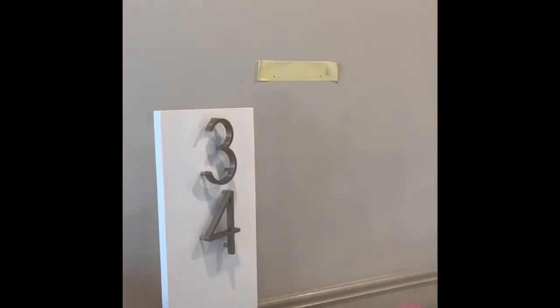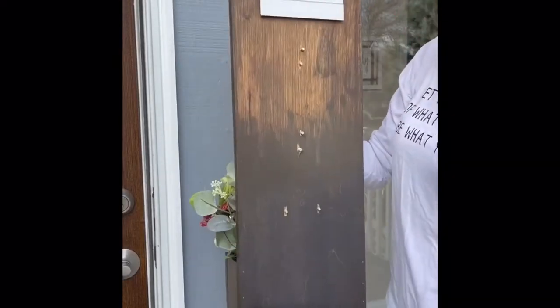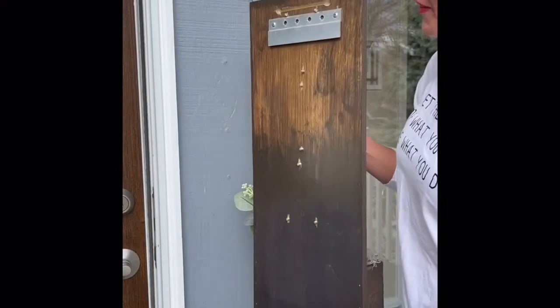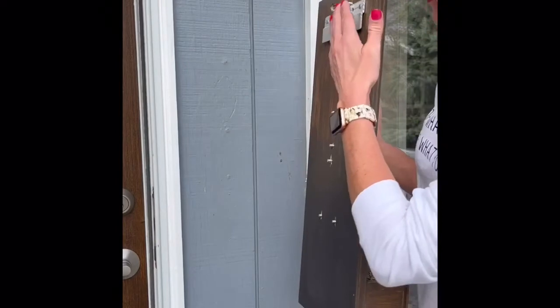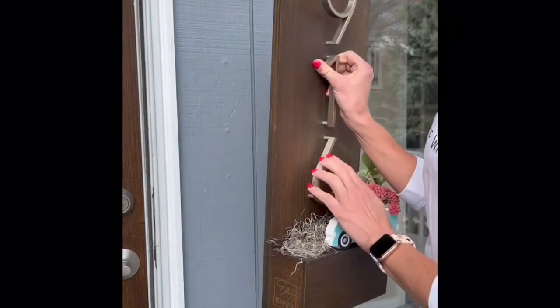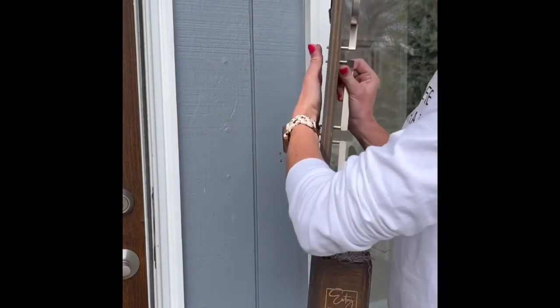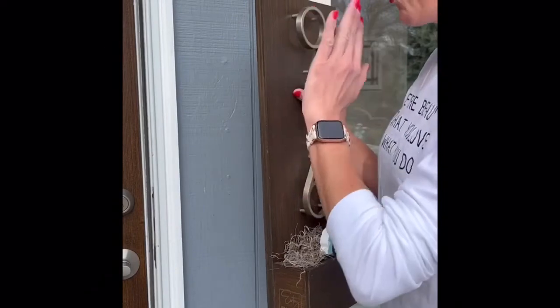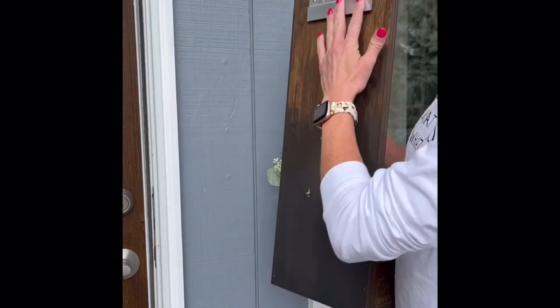I'm going to show you how it looks on the outside of my house. So it's French cleat again, and basically this is my sign, and it's dirty because it's been up for a year. But French cleat allows an easy install method, and when we have these screws that poke through to hold the numbers, it holds it away from the house so they don't go against it. And they'll sit against it, but it won't move. Just wanted to show you from the actual application of it.